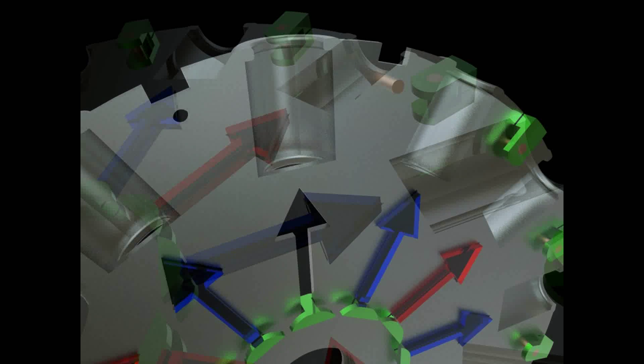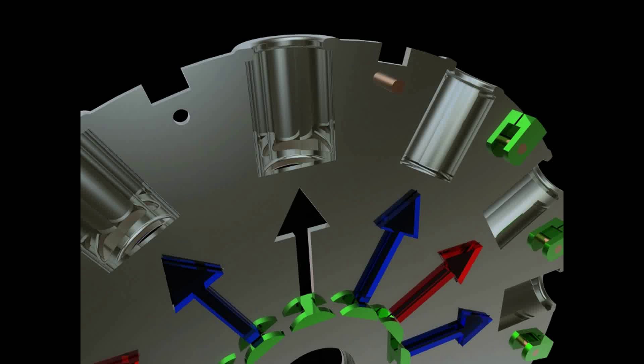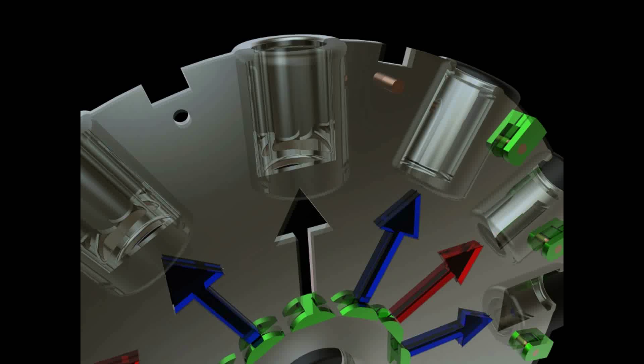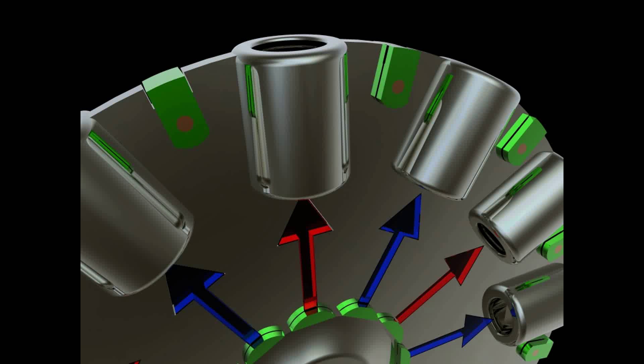They are poking up a little bit because we're looking at the bottom half of the clamshell. This is where I'm showing how the magnet actually goes in. As you can see, it's held together on the front and the back and sandwiched between the two halves of the rotor. Here's the rotor coming back together and how the clips actually clip in.